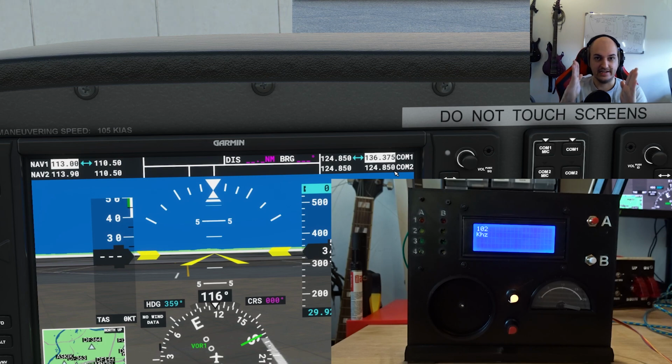Now, if we add a delay, so let's say we hit this point and it keeps rotating, so we add a delay, but the rotation is still in movement, right? The moment the delay stops, it could be that you already ticked 3 times, but because this one is now low while this one was high, for instance, it thinks you took a step back, because there's a delay between the reading of the first one and the last one, but the physical position has actually changed.